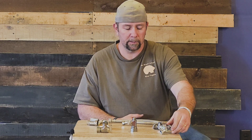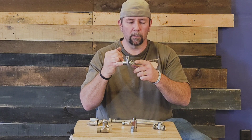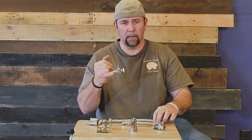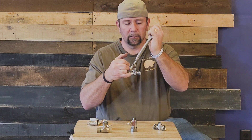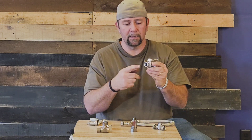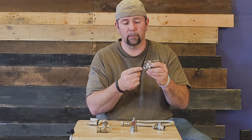This one is a right angle quarter turn with a 3/8 valve on top, and it will hook up for your supply lines to your toilet and for your faucet — it screws right on top. The back of this one is set up for a 3/8 nipple.